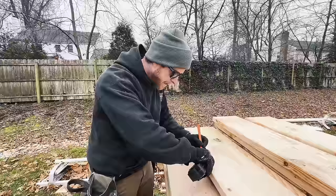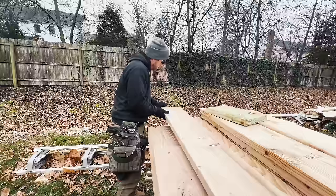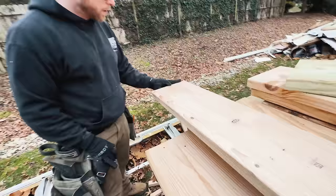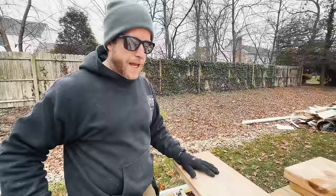So essentially that's 5 1/4 off of the outside of our beam. So that was just a placeholder. Now we've got our finished cut. We'll cut this little bit off right here, that's gonna plane down with the outside of our beam. We'll cut this right here. And all we need bearing on that is at least 3 1/2 inches. We're gonna have a little bit over 4 sitting on top of that beam, and then we're gonna scab in our overhang detail, and we'll be good to go.